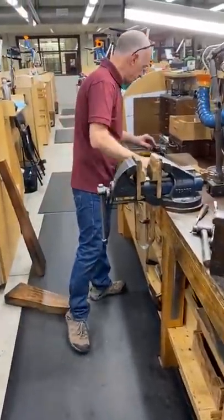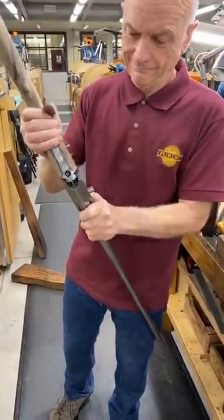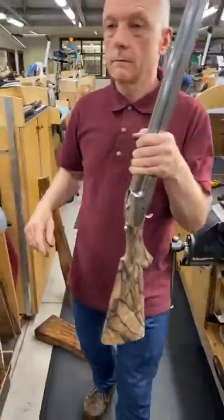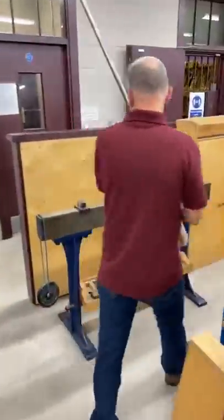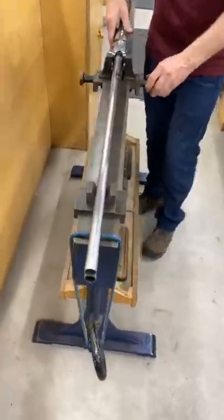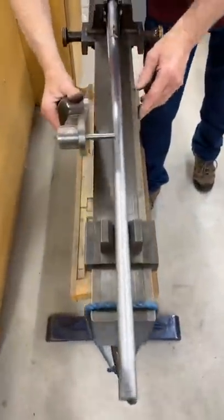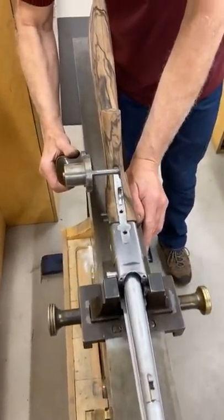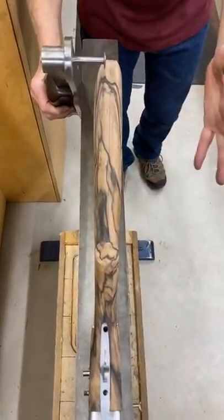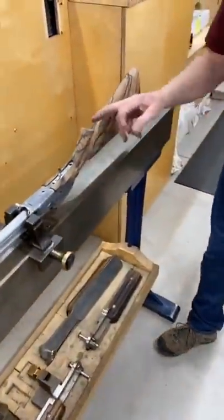Right, back to my colours. So now we're ready to make up. Call it a middler. So, this line runs right down the gun the whole way until we get to the back of the action. And then you're starting to see cast. So the stock's coming over this way slightly. Remembering really, this is still a block at the moment. So I'd mark that centre line on the back of the stock and under the comb and the top of the hand.